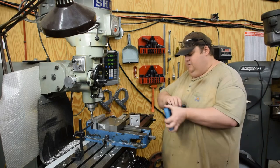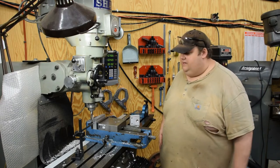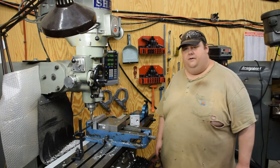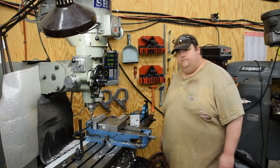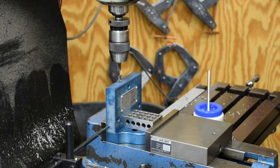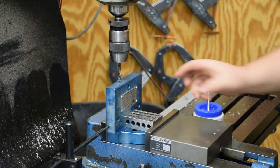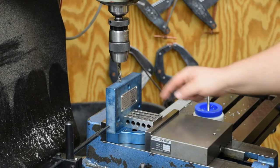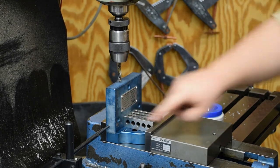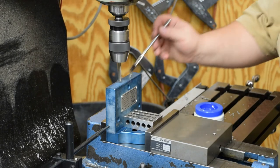I've got the bottom piece made. I'm going to have this piece done in about ten minutes — probably won't record the drilling and tapping since you've all seen that before. Here we are with the modification that's got to be done to the actual clamp: I'm going to drill two holes up here and tap them 3/8-16. This thing has got a round shape with a split so it'll clamp down. I've got it on the bottom of the vise against the fixed jaw, and a 1-2-3 block so the jaw is clamping on that surface against the fixed jaw in the back. It's in there pretty solid.